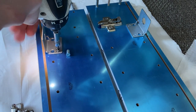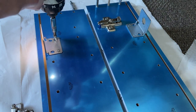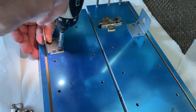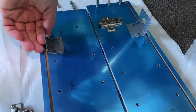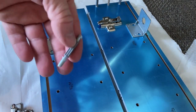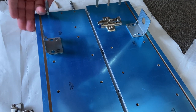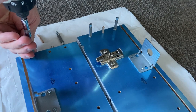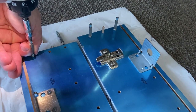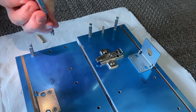I'm using the screw gun and my weight and the clutch to tighten it down but not over-tighten it. Make sure the screws are actually going down and not just spinning. For the threaded studs, apply some pressure vertically because they only have so many screw threads. Hold onto it, making sure it's plumb both left-right and front-back - that's why I'm holding the whole thing together here and going slowly but definitely down.